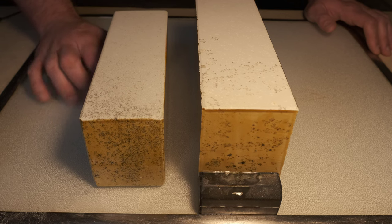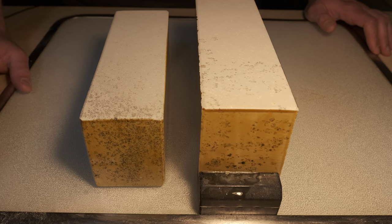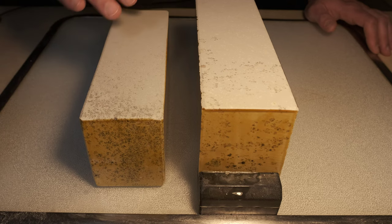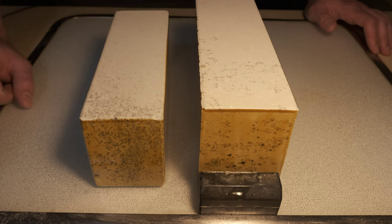Aizu has a pretty good reputation, and personally it is most definitely my favorite of the Japanese whetstones, especially in the Nakatoishi range. If I had to have one whetstone forever, it would probably be these Aizu. It would be unfortunate, because I would never be able to use a straight razor again. These do not do well besides bevel setting for straight razors, but they are really wonderful stones insofar as polishing and sharpening knives and other such instruments.